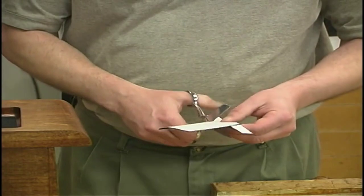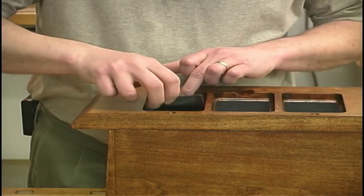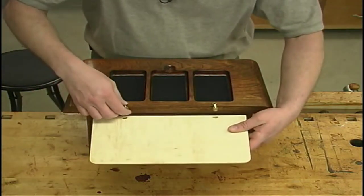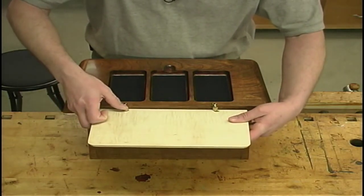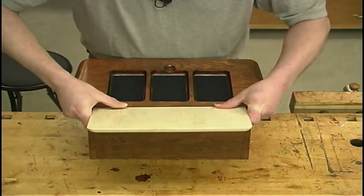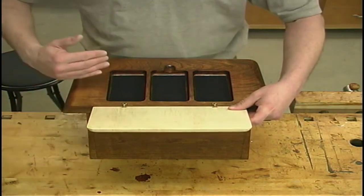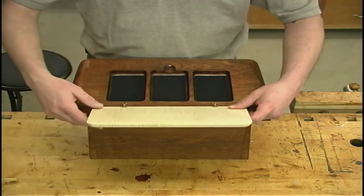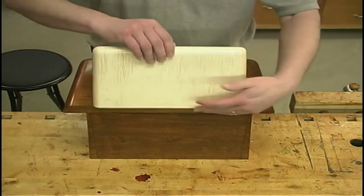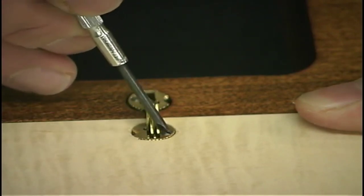Some self-adhesive felt makes a nice liner for those pockets on the top of our little chest. Now unfold your barrel hinges so that they're open and get them started in the holes. Take the lid and get the barrel hinges started in there — the whole point of this is to get the two hinges lined up so that they're opening perpendicular to the back edge of the chest. Get them in as far as you can — hopefully you drilled your holes to the proper depth, which would be half the length of the barrel hinge. Close the lid and push it down — that should seat the two barrels into both the lid and the top of our chest. Then taking a very small screwdriver, tighten up those little screws that expand the barrel and hold them into the holes.